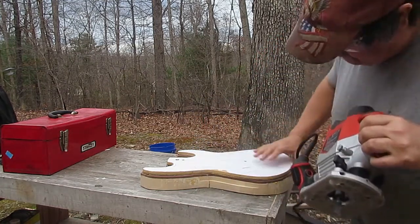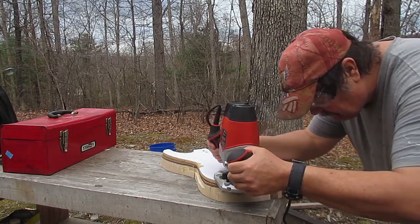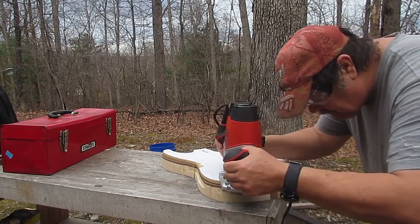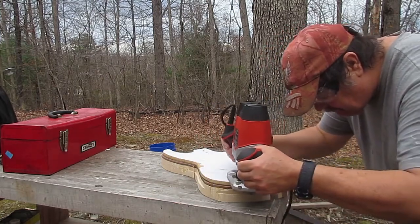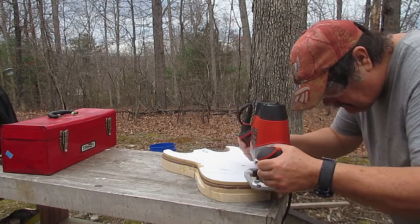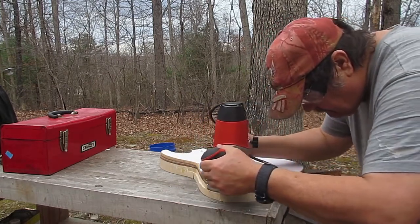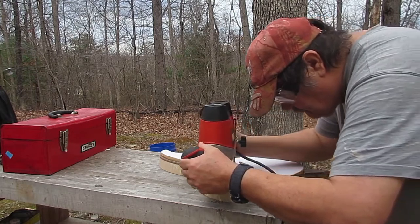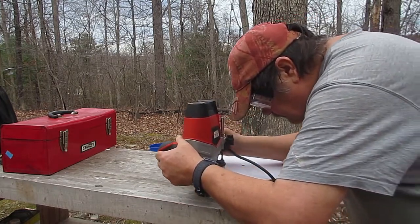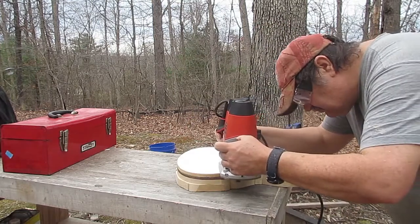I have to be careful and watch how big a cut I make — I'll make several small passes in every section of the body. If I make too deep a cut, or if I move the router in the wrong direction against the grain of the wood, you can get what's known as router tear-out. The bit is spinning at such a high rate of speed with so much torque that it will actually rip out huge chunks of wood from the instrument body if I'm not very cautious.